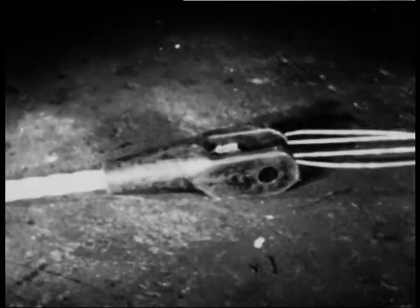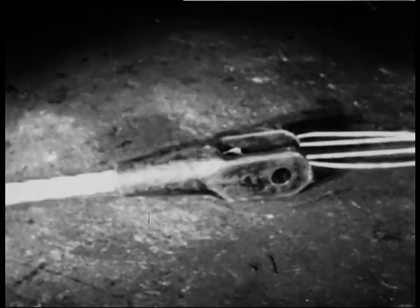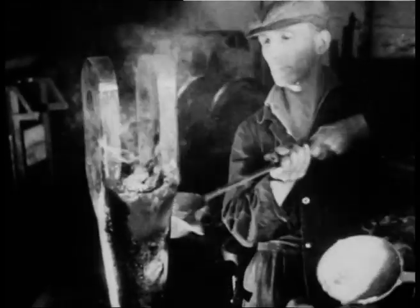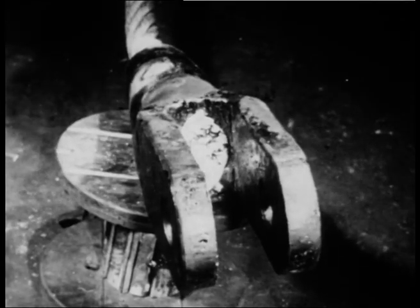And the socket is adjusted with the cone lying so, ready for metalling. After heating and fluxing, the hot white metal is poured into the body of the socket over the cone, and this is the effect that is produced.